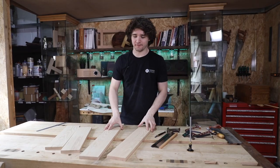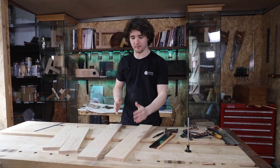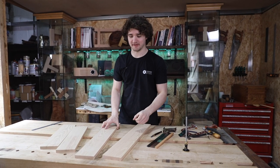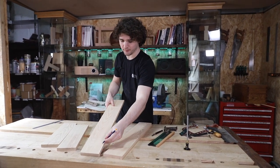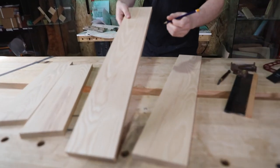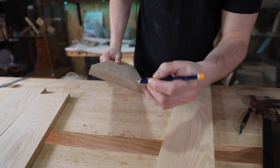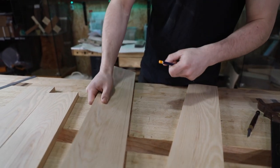So much kit. So for this dovetailed carcass, we are going to be doing, obviously, dovetails on the corners, but we're going to be putting a miter on the back, which will hide a groove that is going to hold the back panel in. So if we've got a groove going all the way up there and along the top panels as well, if you cut a through dovetail, it's visible on the end grain there, if this was a tail or something going up through the top. So we're going to be disguising that in a miter, which I'll show you how to cut now.